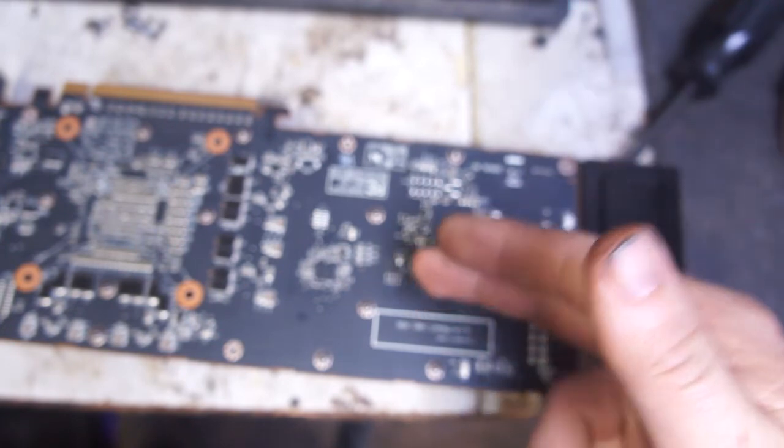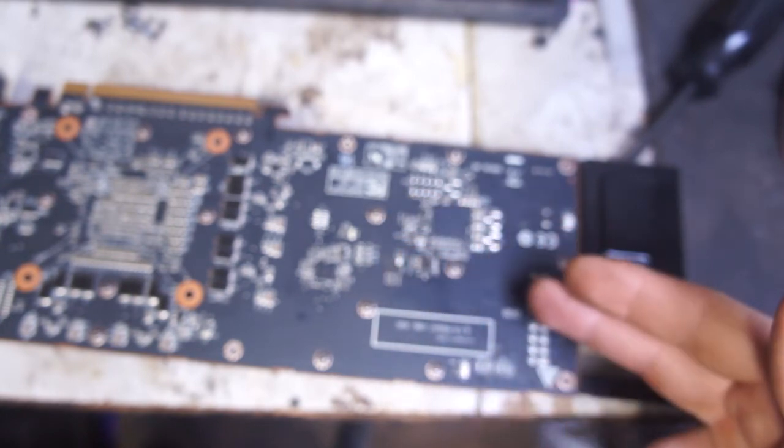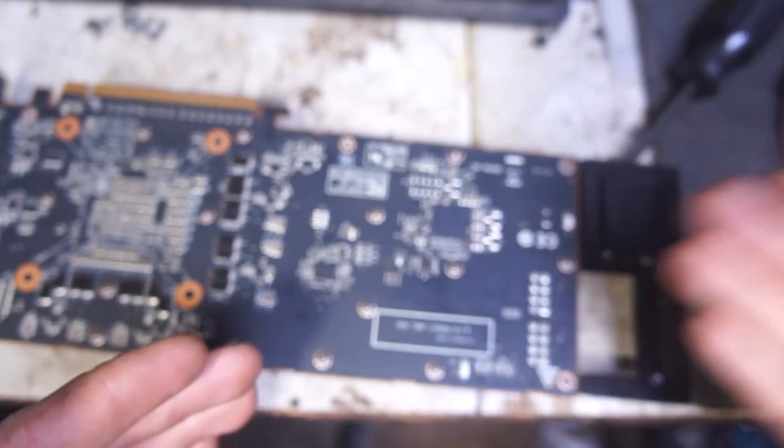Since you're using a USB programmer, if the card just doesn't work or the flash fails and you flash something corrupted, just try again — flash it until it's on there, and you don't have to worry about bricking it. It's probably a good idea to after you flash it, read it back and use some kind of hex editor compare tool to compare what you read with the same file you tried to put on it and make sure they're the same. It is technically possible to flash something that would jack the voltage up and fry it, but if what you flashed matches the original file you tried to flash, you should be good.